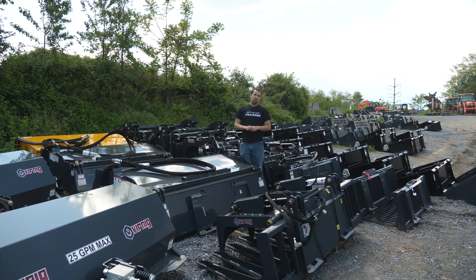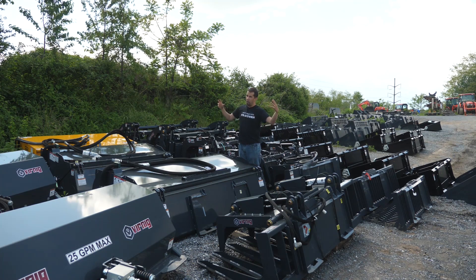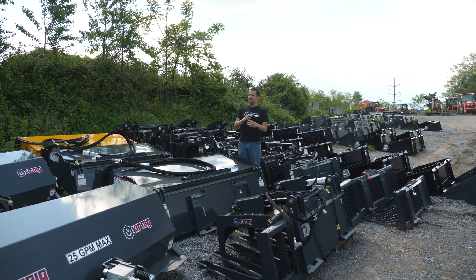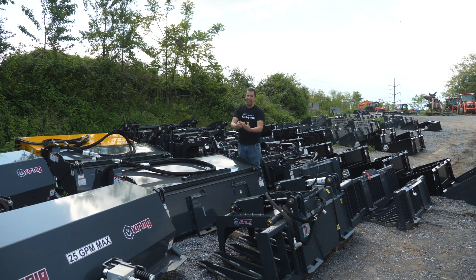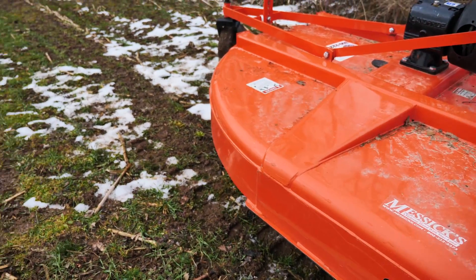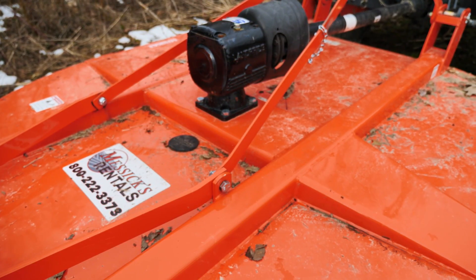With that 12 horsepower, what are we really going to accomplish? We could go pin a 60-inch hydraulic-powered rotary cutter out there, but with 12 horsepower we're not going to do a whole lot of good with it. That's not to say there aren't some applications for some of these implements — we're starting to sell some of them now and we think they're really cool, with more videos coming. But we need to keep in mind the amount of horsepower we're putting out there. If you're going to mow a field with grass that's three feet high, you're far better off putting a rotary mower behind the tractor on the three-point hitch where it's driven with the PTO, where that shaft is transferring the engine's power much more efficiently.